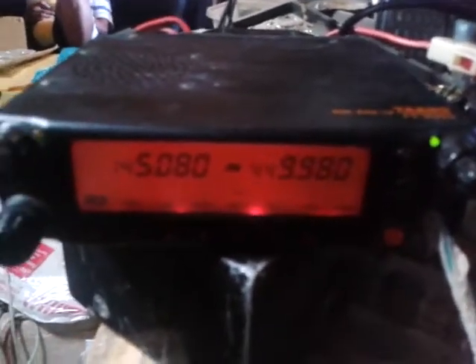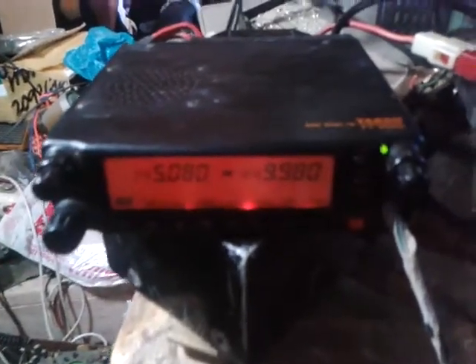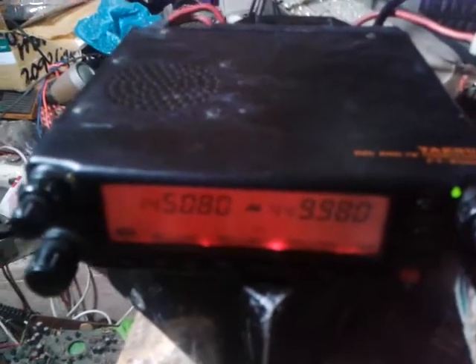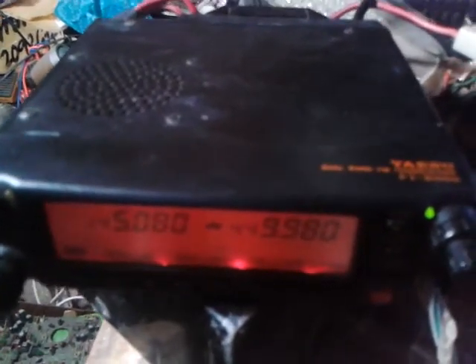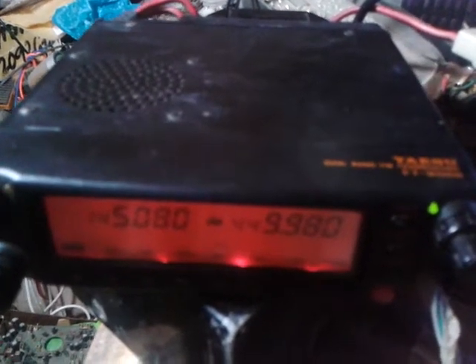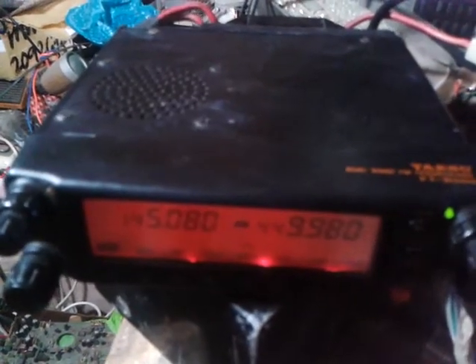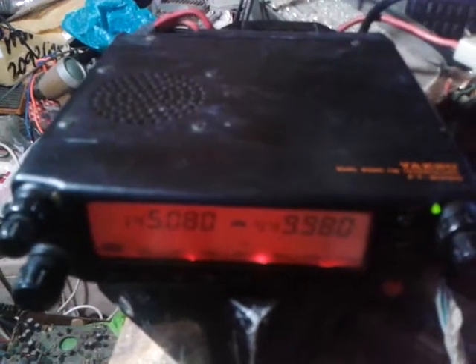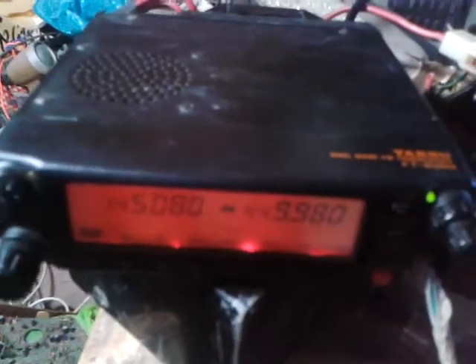As you can see, the trouble of this unit was to replace the 12 volt regulator — that's why it only powered on at nine volts, but the reference voltage of the 12 volt regulator had no output. When I replaced the 12 volt regulator, I could then finalize the main trouble. I found that the IC of the VHF and UHF amplifier — two pieces of audio amplifier — were also replaced.